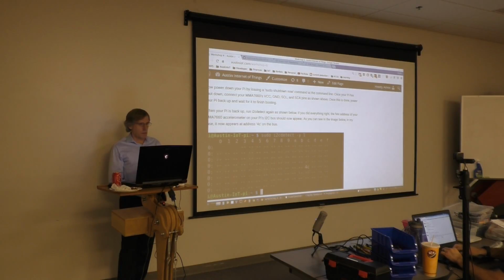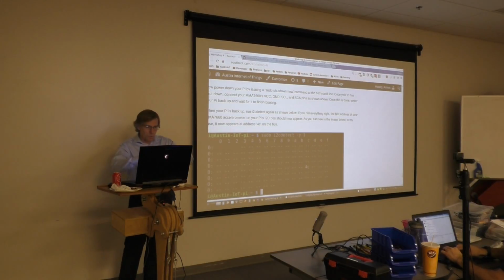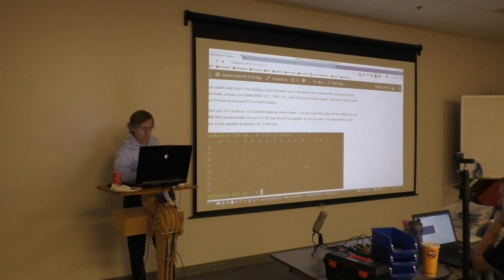And what's the meaning of the rows and columns of this output? Boy, I was straining to remember that from my digital logic classes. I know that it's 0 through F. So across, the first word is that first row, and then they give you the bit or byte positions. Well, the word is laid out there, and you just have 16. Maybe the I2C is organized around the concept of registers. Maybe you're reading that particular register, or this is a register map, and that's the value in the register.